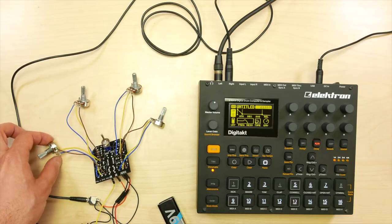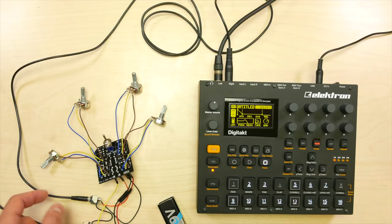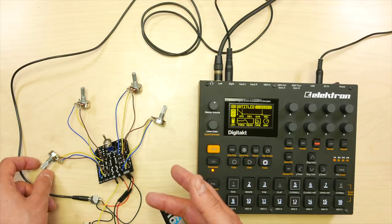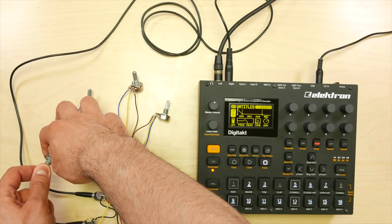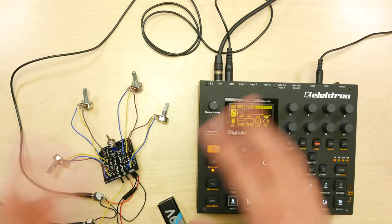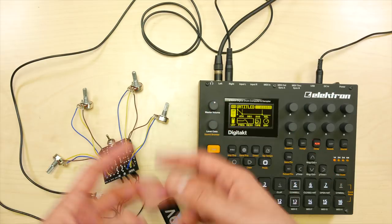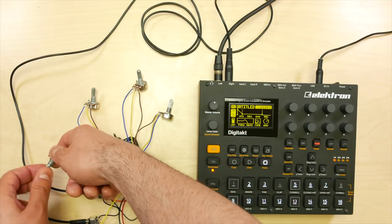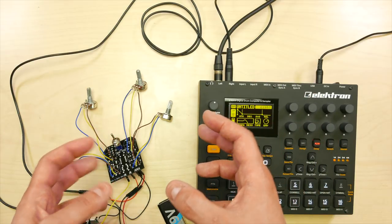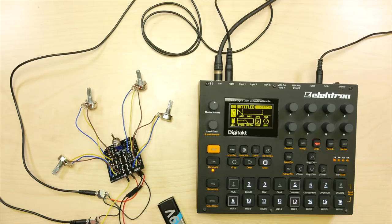This is called the Roots mod, I think, or Roots mod, I'm not really sure how to pronounce that, but it lets you tighten up the distortion. If it's all the way down, like so, low frequencies, high frequencies, everything is causing those diodes to distort, and so it becomes very uncontrolled and wild. Whereas if you turn this closer to the top, where I like it, it tends to control that distortion because it's only letting the higher frequencies cause the distortion to happen in the diodes.